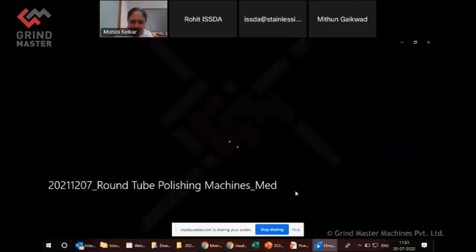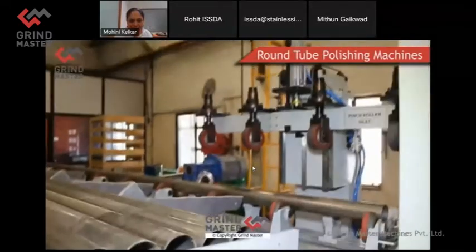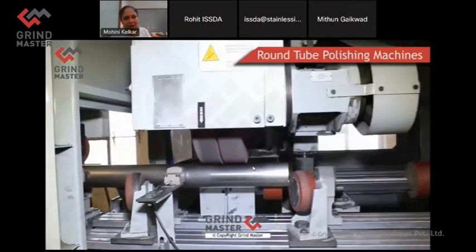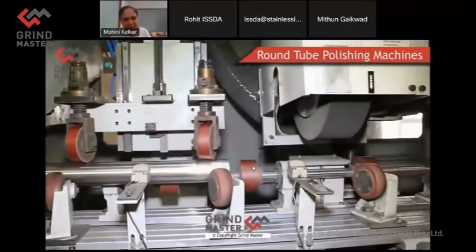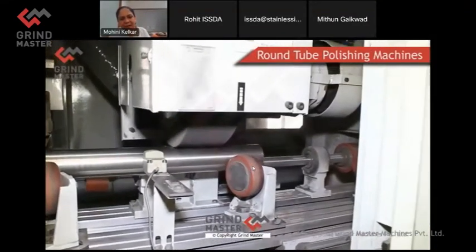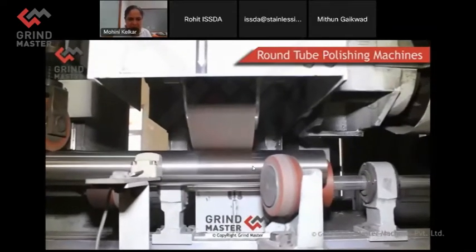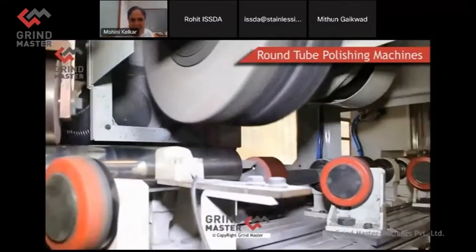So let us run the tube polishing video. Some videos I'll run, and then I'll talk about it. I have told you the round tube fully automatic machine for a big diameter tube. And see, even the loaders, we have different varieties depending on the weight of the tube, the diameter of the tube or a bar, if it is a seamless tube or if it is a lightweight tube. The roller supports also change. So these are really the solutions which can be provided only by partnering with the customer. We need to understand your purpose of this machine, why you want it, the deliverables, and then work together to give you the right solution.